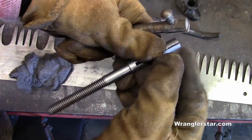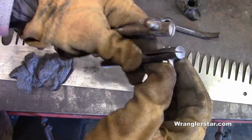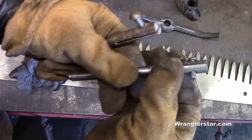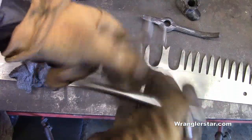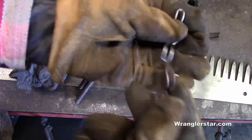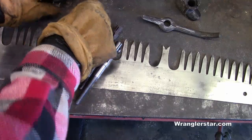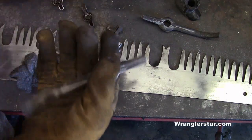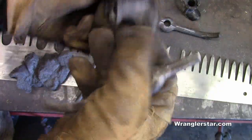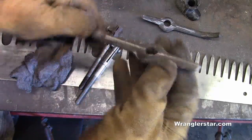These are nice — look how they're retained. They're peened on the end with a hole a little bit bigger, so you can open it, install it, but you won't lose the pin out in the field. Just little details — that's clever. We've got the wing nuts as well. You can see the before and after — these cleaned up really nice. There are three other additional parts; these pieces are cast and painted. The paint's still good on them, just a little dusty and dirty. No real rust, so we'll just clean those up with the steel wool.